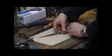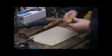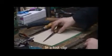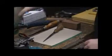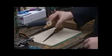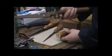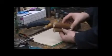Here is the fid — as you can see the handle's broken, it's been pounded upon quite a lot. So what we're going to do is replace that. I did mention a piece of mahogany, but I've also found a piece of cherry. I've found what I believe to be an ash handle which came off essentially the other half of these secateurs or shears. I think I'm going to use that because it's very close to the actual size that I need and we know it's good handle material.